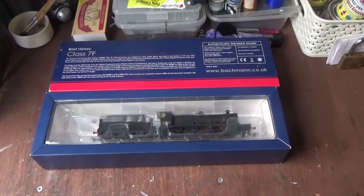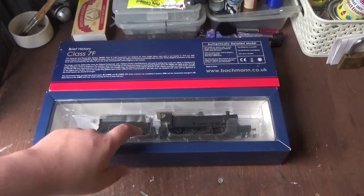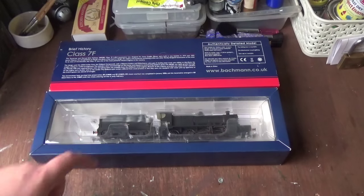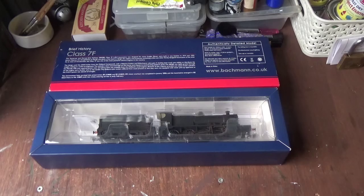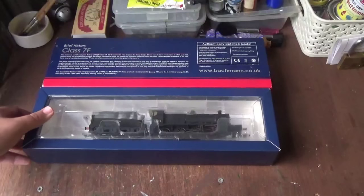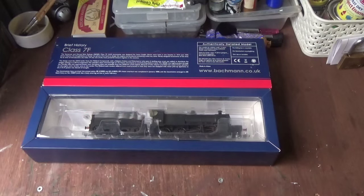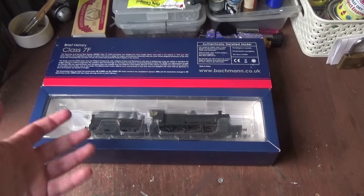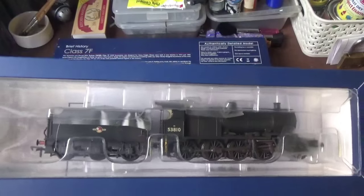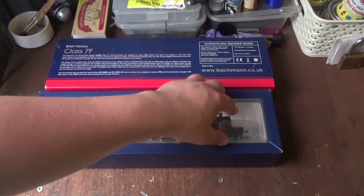Some interesting information is that they used the G9AS boilers, which were used on the Midland compounds. The cylinders are sloped to prevent it from fouling the platform faces, and they have fireboxes and Walschaerts valve gear, which, as you can see, is just there. And Clayton provided steam brake cylinders on the locomotive due to the power needed over the Mendip hills, as these locomotives ran on the Somerset and Dorset Joint Railway, the S&D, which is quite famous. Well, the locomotives needed the power anyway.